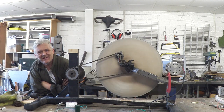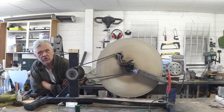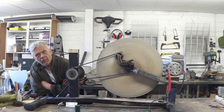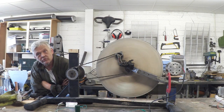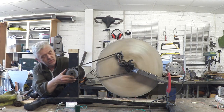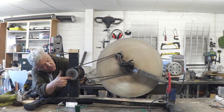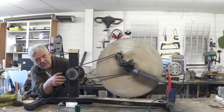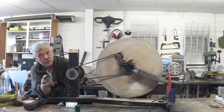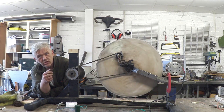Those LEDs will stay on for ages from just that little bit of a spin — about an hour or so, it's crazy. There are obvious improvements we're going to make to this; this is just to demonstrate the KERS principle and how you can actually build one yourself. The obvious improvements are going to be to do with the gearing. We've got this little cog going to a not-much-smaller cog. If we made this cog bigger we'd be able to get a better speed on the actual flywheel. On the reverse side we could also change that gear ratio.